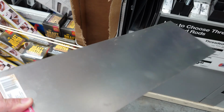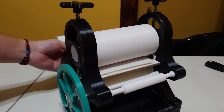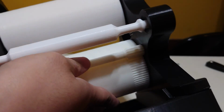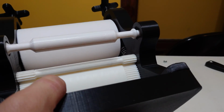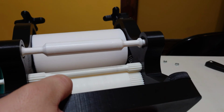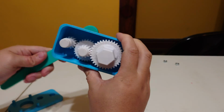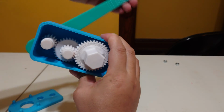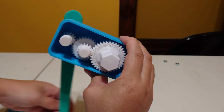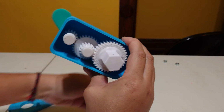I like the options. And for one pinion and spur gear, I had to make the teeth really small in order to get that gear reduction that I really wanted, and as a result there's only about 1 millimeter of contact between the two, and so I found that under high stresses the tiny little pinion gear would flex, and then once it started flexing, it wouldn't make contact with the spur gears and you'd be skipping gears, so it didn't work out, and I had to scrap this idea and I went with the gearbox. And I know the gearbox isn't as sleek as the original design, but the gears have much wider teeth, and so they have much more catch, and I can get it to deliver a lot more power, so it's well worth the trade-off.